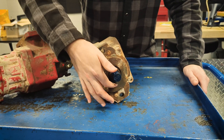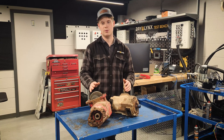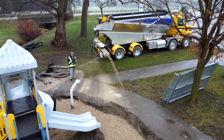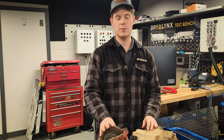Your manufacturer's owner's manual at both your pump and PTO will have information on the type of lubricant you should be using and how often it should be checked. Making sure that you grease your PTO and pump input and output shafts regularly will ensure that you have as little downtime as possible. Thanks for watching this tech tip video and please reach out to Baylinks for any questions.